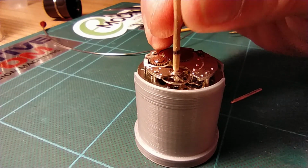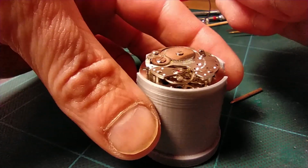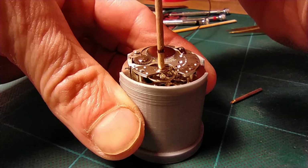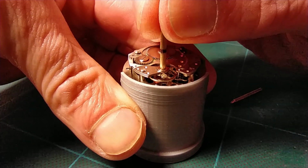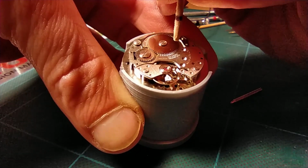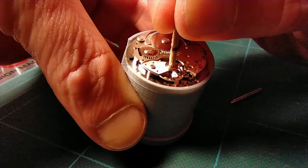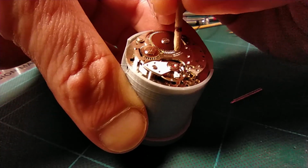And to use it, this is going to be a little bit tricky because I'm going to have to reach around the camera here. But hopefully you can see what's going on. You're basically putting this down here, and because of the hollowed out section, it allows the edges to press down on the spring, and you rotate it a little. Then you have to lift it and check, and just keep doing that until you are aligned, and the spring should align with the notches accordingly.